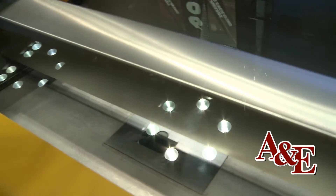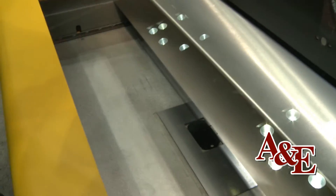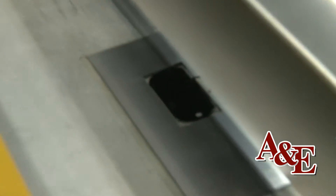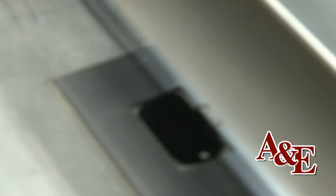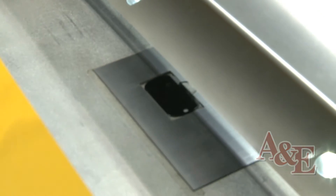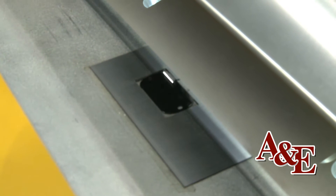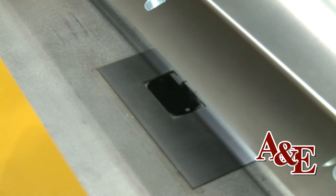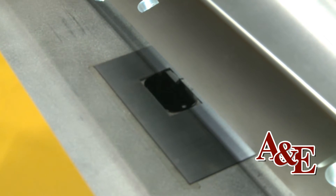At this point the laser is actually engraving into the material, vaporizing the material, and achieving the graphic into the material to produce a photograph onto the anodized tag. We have a spot size smaller than one thousandth of an inch that can pulse the laser up to a million times per second to achieve any graphics onto virtually any material on the planet.